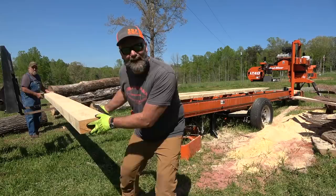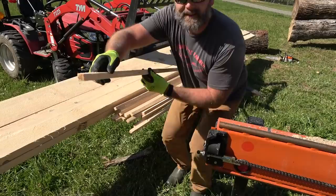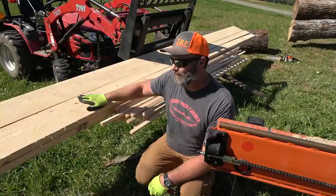In case you stuck around after the credits, these are the stickers — just one-by-one stickers. You want to use the same species sticker for the same species lumber: pine lumber gets a pine sticker, oak gets an oak sticker, ash gets an ash sticker. We'll cut these into four-foot lengths and put them every 16 inches. See you next time.